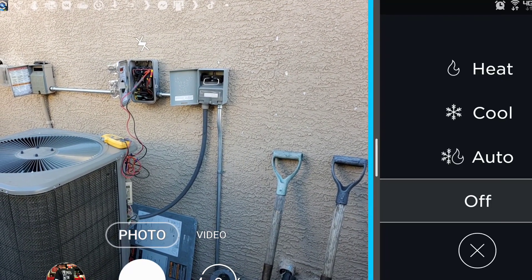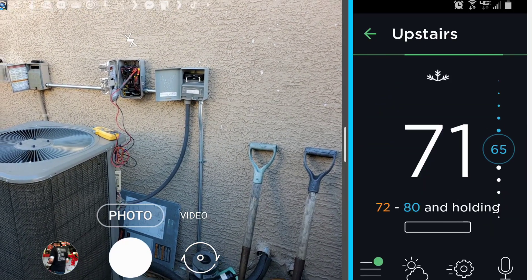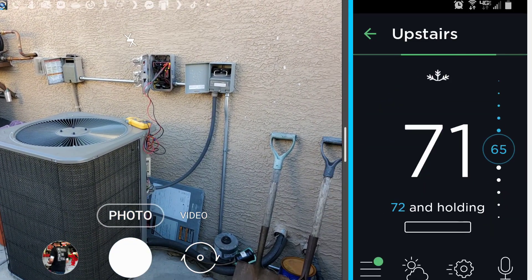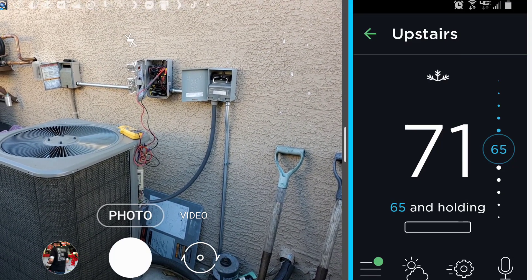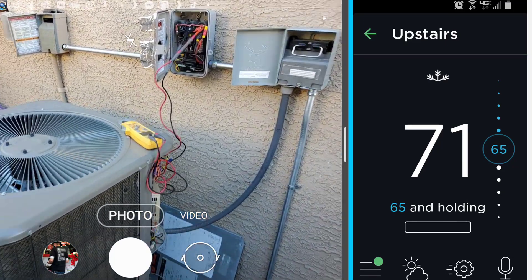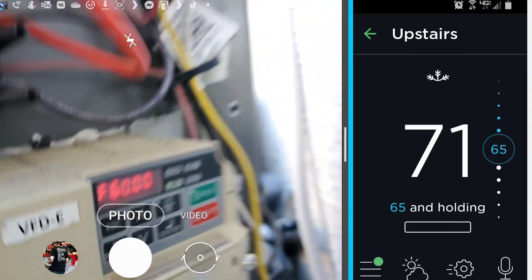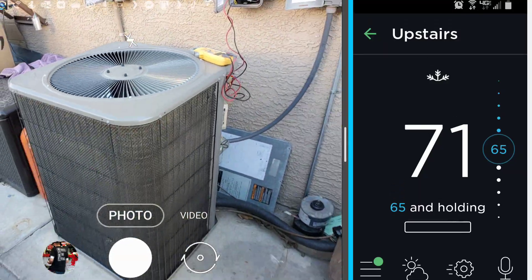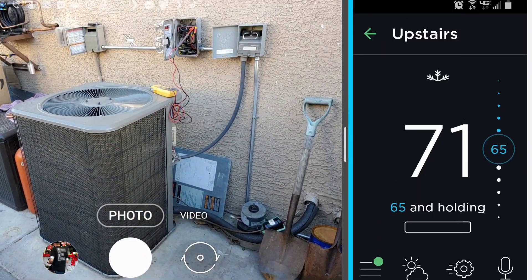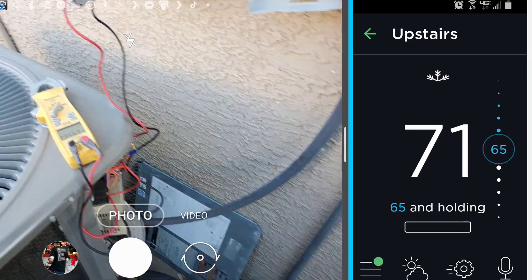So I'm going to switch my system to cool, switch it way down. I don't know if it'll go to second stage right away or not. That sounds like 60 hertz to me. And head pressure is going to get up there because of the fan not running — I'd have to plug in the AC power for that or hook the fan up to the output of the VFD.